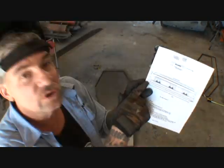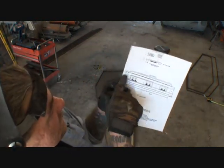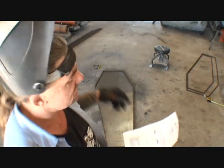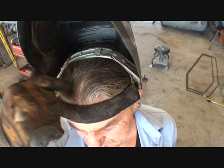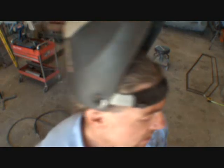So we got 17 and a quarter inches. If it's 17 and a quarter inches, and those are half inch each — I need to make my sticks 16 and a quarter inches. You just answered the question before I can even think it out. 16 and a quarter inches. And you thought this was hard. So I'll cut all those out.